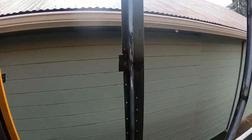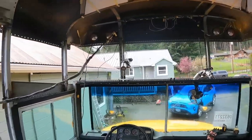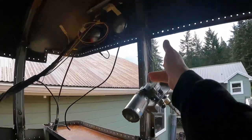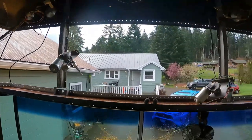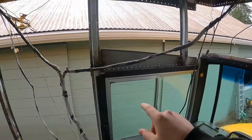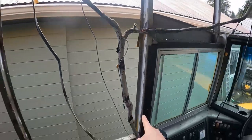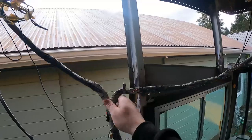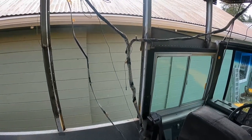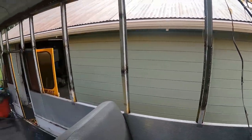So we still gotta come in here and grind down our welds a little bit here and there, just to make sure the windows are gonna fit in there. And then we got the front done there. We have a ton of other stuff to do along with this, like the wiper motor harness needs to be extended so it can come all the way back down. Oh, my snippers. This harness here needs to be cut and extended from this point here, so this can all go back up, because we didn't lengthen anything around the edge here. That'll all still tuck up in there, but now this harness is not long enough to reach, so that's a big project we're going to have to work on, but that's kind of later. I'm not really too concerned about that.